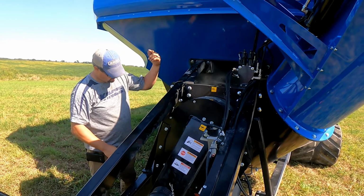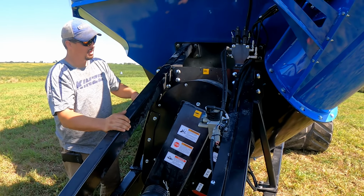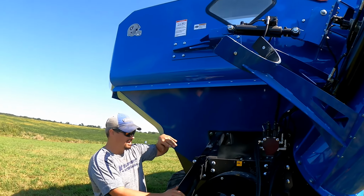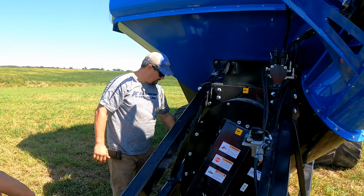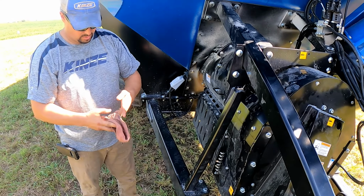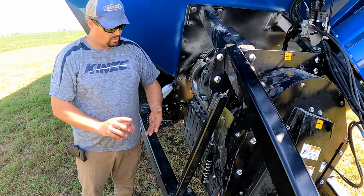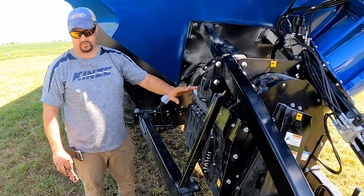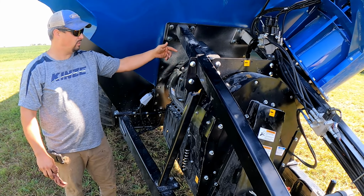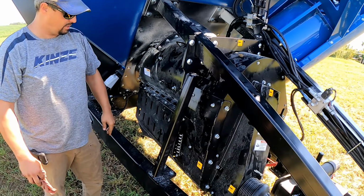As we run up, it'll run to about right about there. And as you come back, you can see we're maxed out. So we get about 2 feet of reach and 2 feet of height on that. On the back side here, we've added a grease bank. These are all weekly zerks on our grease bank. So it's your whole grain transfer system on the front side: your two main front ones, the idler in the back, the carrier on this guy.